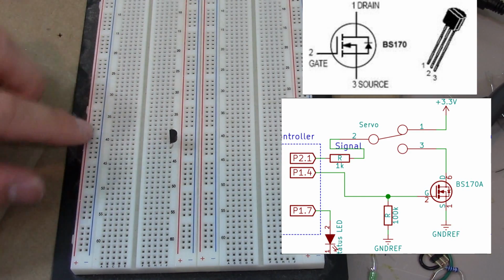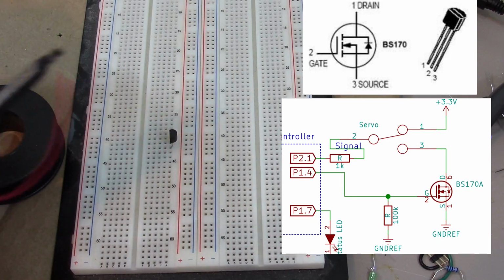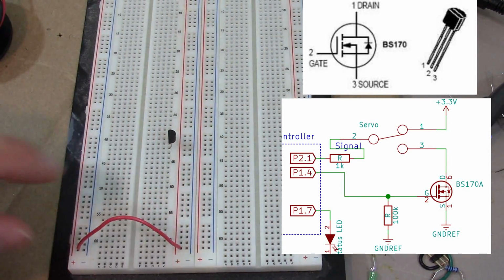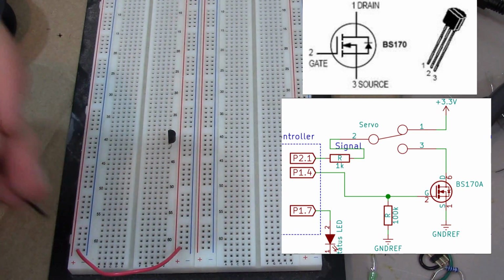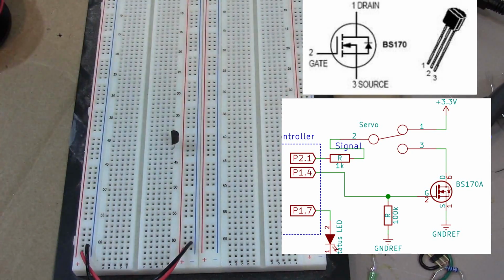Okay. And generally whenever I'm building breadboards out, I like to run wires across the bottom so that I can connect my power on both sides. So let's go ahead and do that. I'm going to grab one of my jumper wires, strip it off. Just like that. We're going to run from red to red down here at the bottom. We'll do the same for black, bottom to bottom like that. Okay, so now we have power connected down this line, which is helpful later on.